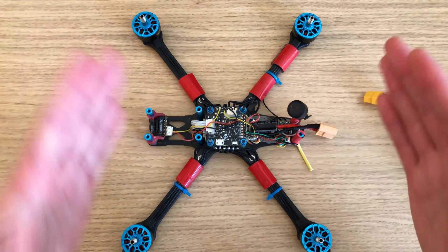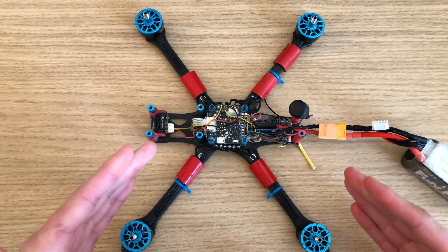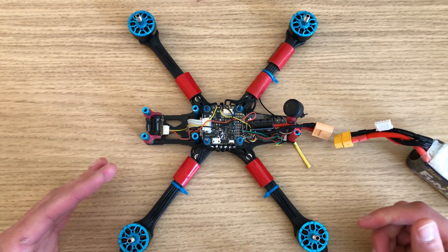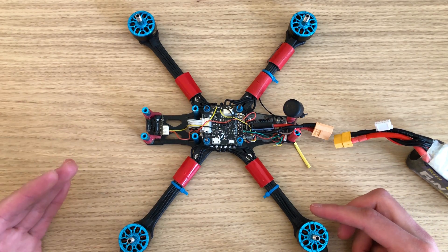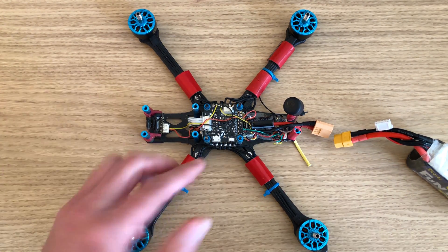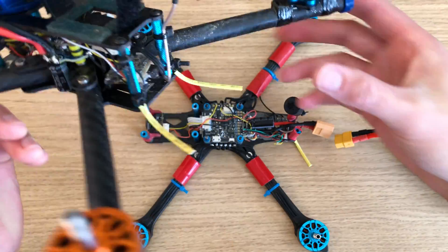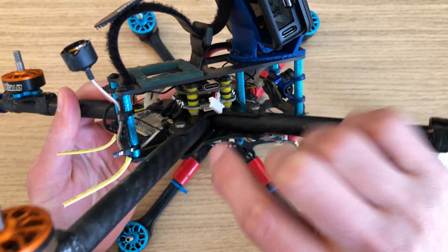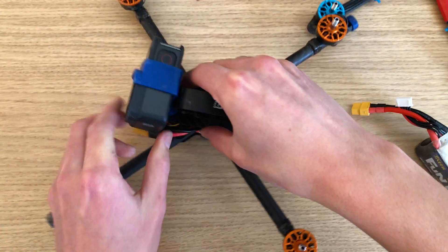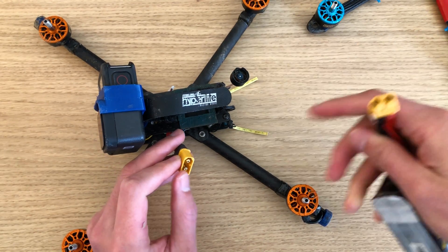If a component is not getting power at all, it's not going to function. Another thing I've noticed is that when I plug it in, we get the click with a little spark between the connectors, but there's no beeps from the motors at all. I'm not 100% sure if this means the ESC is not working properly, because I can't remember if the ESC is supposed to make beeps when the flight controller gets no power and isn't sending a signal to the ESC. So to verify, I've got a drone that I know works, with the flight controller completely disconnected, so only the motors and battery cable are connected to the ESC.